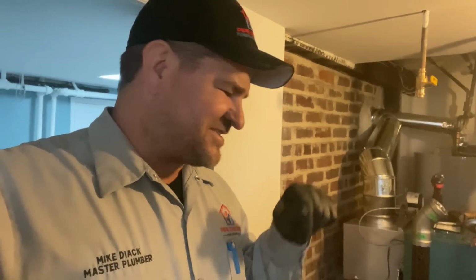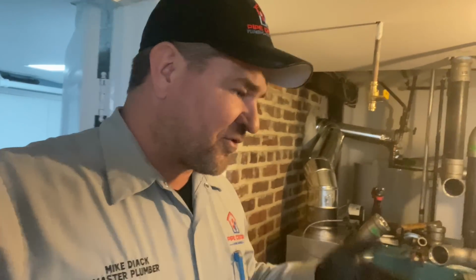The reason why you need to skim is because plumbers, well, we're messy, generally. And when we cut and thread pipe with cutting oil, that oil gets inside the pipe. I was taught years ago when I was a steam fitter at the U.S. Merchant Marine Academy to very diligently clean the pipe of any oil residue. If you clean the pipe of any oil residue, you don't have to skim the boiler. Now, granted, when they manufacture this boiler, there's some oils in the process, and that's why I use Surge X. Surge X helps give us some of that dry steam, and knock on wood, be good.